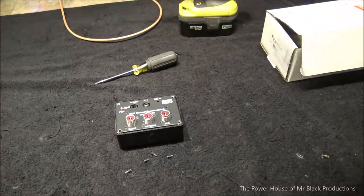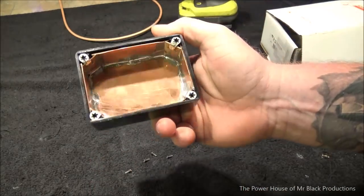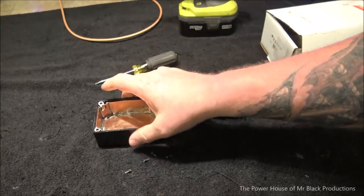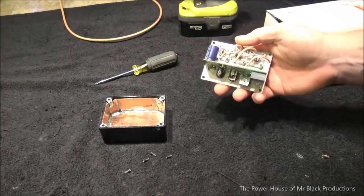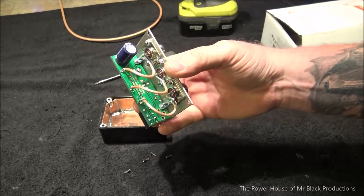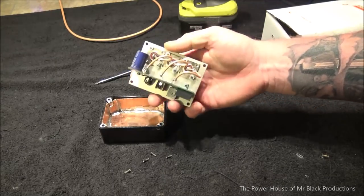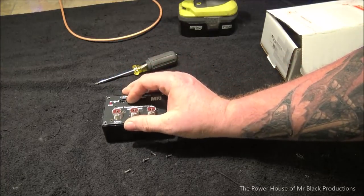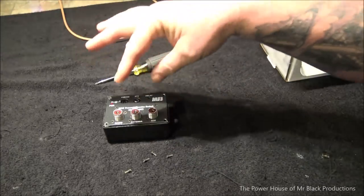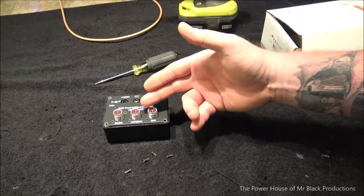So I thought, well, I'm going to try and take it another step. So I went into the inside of mine and heavily modified it. I made it a completely copper-lined box because I didn't want to go through the pain in the process of trying to find the exact aluminum case this would go to because MFJ is too cheap. Went and neutralized, put everything with 316 coax in it because it just had bare wire in there, you guys. The RF leak inside this thing was horrible. Anyhow, I was able to get it down an additional amount from the 10 dBs attenuation. 10 dBs, that's it. You think about that signal attenuation, you're going to put 100 watts by this thing.